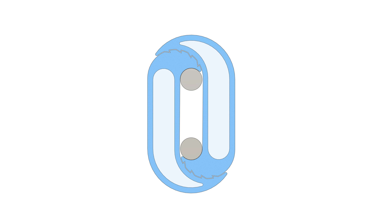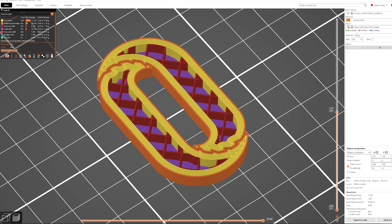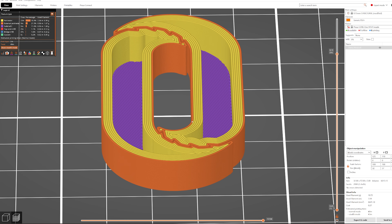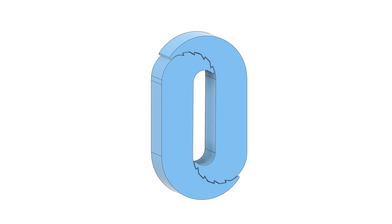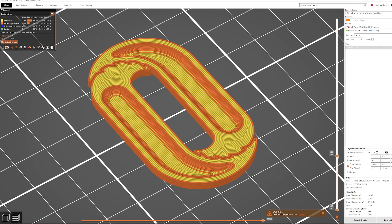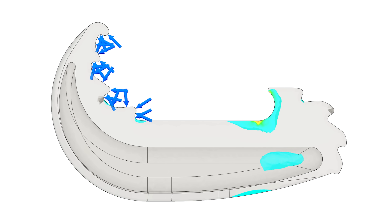I considered making the hook hollow, because like an I-beam, it's ideal to have as much material as possible in tension and compression. Thickening the design while keeping the same cross-sectional area should strengthen the outer C sections and potentially take some load off the teeth. This is easy to do in the slicer by adjusting the infill percentage, but with 0% infill the cross-section looks like a box section, and the 90-degree angles between side walls and top/bottom layers could cause stress concentrations. So my idea was to design a custom hollow section with filleted internal corners to prevent these stress concentrations, then print the design as 100% perimeter walls, and run it through finite element analysis to see the high stress areas and make adjustments.